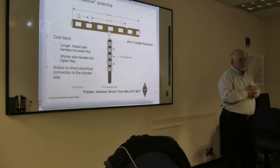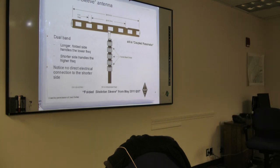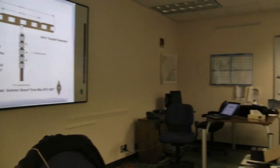The other thing I would chime in on, though, is if anyone's just looking for some direction in terms of what to build, there's a lot of people who just swear by the J-poles as the ultimate emergency communications antenna going in the coax. So if you're looking for something basic with good return in terms of usefulness, the J-pole is a good thing to use. The J-pole is about 5 feet long.